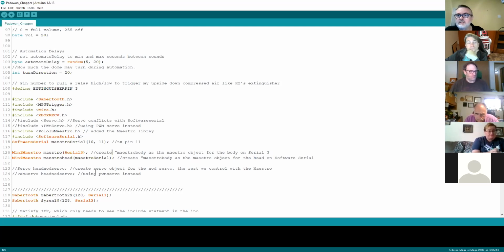hence I've used software serial. What I did do then is I used the servo library to try and control the nod of the head, and that's where I got interference. So I used a different sort of solution to that. But I thought it's worth talking through that serial thing, because otherwise you may get all sorts of glitches and things that you're not quite sure why they are happening.